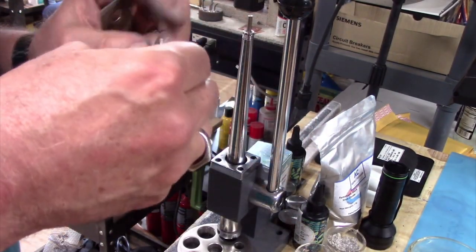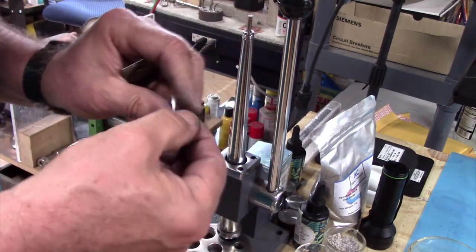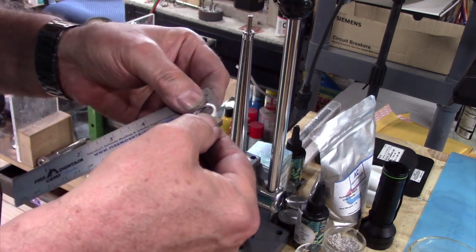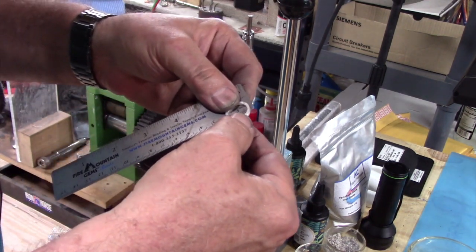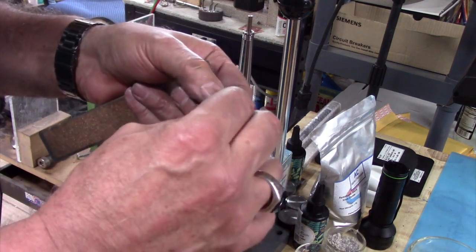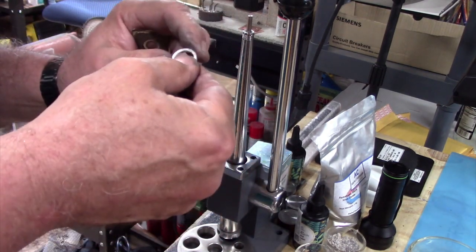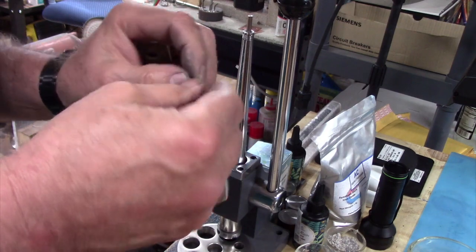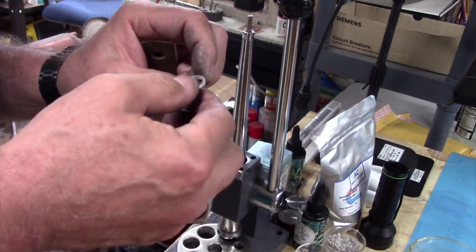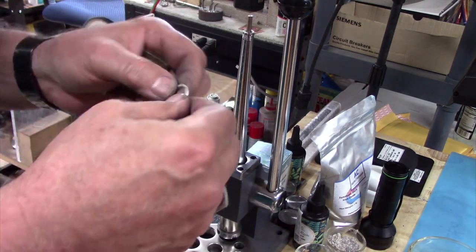Okay, so to begin my seat, I've just made a ring with hard solder that is going to be about 15 millimeters in diameter. Yes, 14 and change. So I'll form this into an oval that I hope will be able to fit pretty closely into the profile of the ring setting. And if not, then this is where you do some futtering around and filing and grinding and just making it fit.